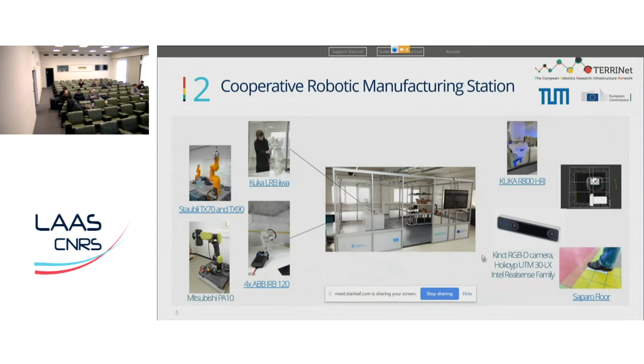On top of that, there is an Epson projector on the ceiling of the work cell with a maximum resolution of 1920 by 1200 pixels. We also have a Kinect version 2 mounted on the top of the work cell, and the pressure of the floor is measured by 40 by 40 tiles and represented as a value between 0 to 1024. The recommended way to use these robot arms is with ROS, which is integrated with all our hardware.